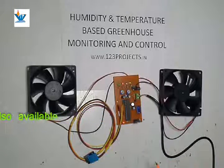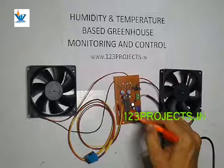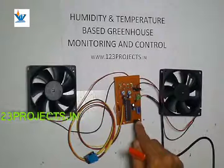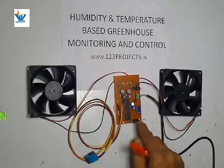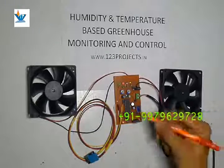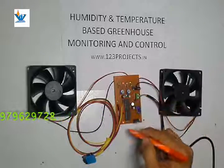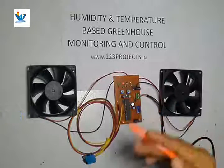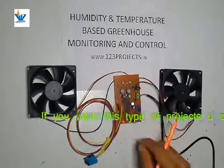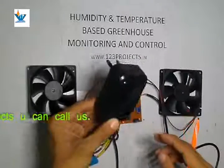The fans control humidity and temperature by circulating air from inside and outside. The electronic circuitry contains a chip from Atmel company. There is also a voltage regulator IC, the 7805, which regulates the unregulated input voltage to a regulated 5 volt DC supply. This sensor and other peripherals cannot work above 5 volts, so this IC is required to protect them. For the power supply, we have used a 12 volt 1 ampere SMPS, which is normally available in the local market.